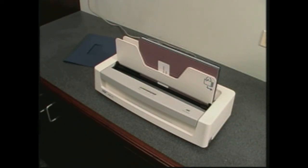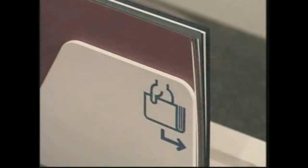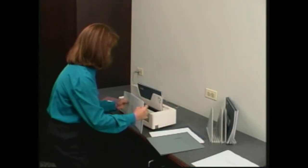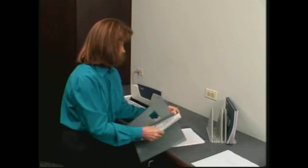Depending on the thickness of the documents, binding time is 36 to 60 seconds. The jogging mechanism takes over during the last 12 seconds to ensure that all of the sheets of the documents are firmly embedded in the adhesive, creating a secure, high-quality bind. An audible indicator lets the operator know that the binding cycle is complete and the document is ready to be removed.